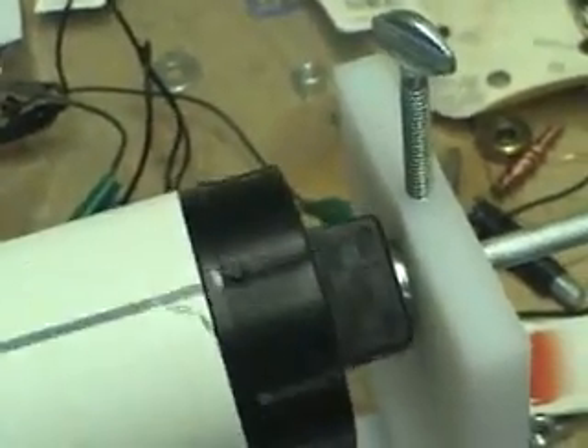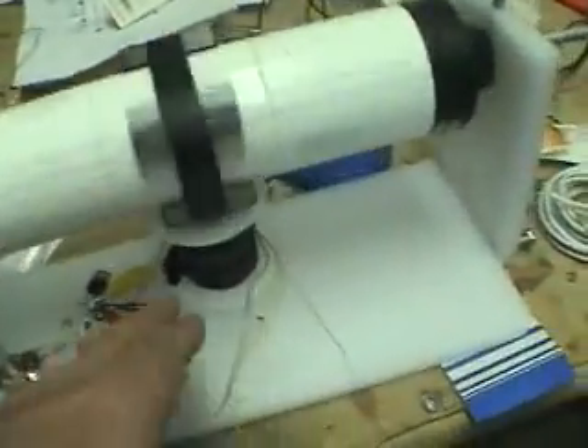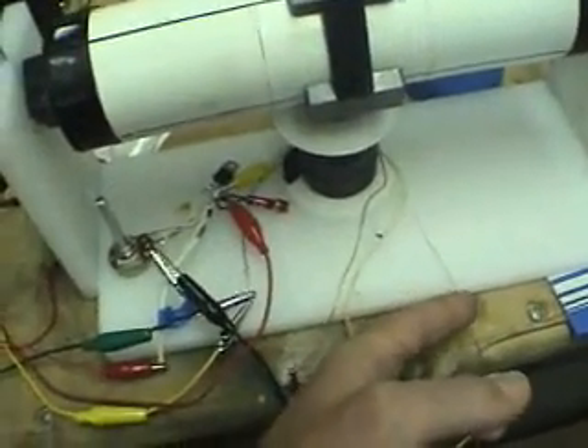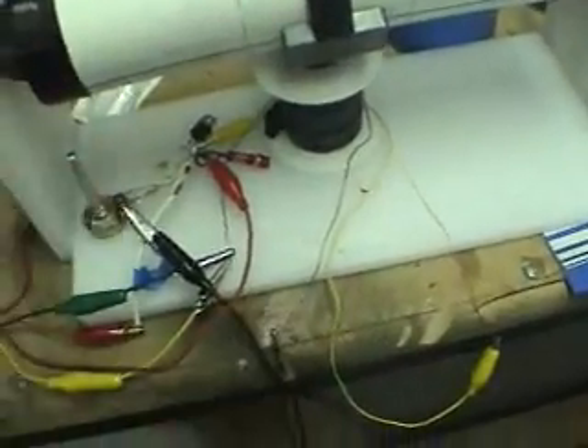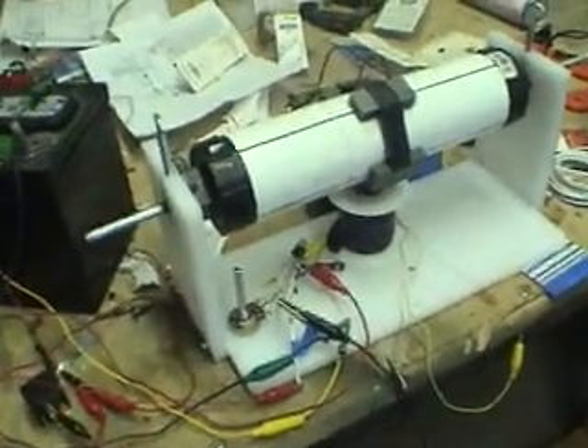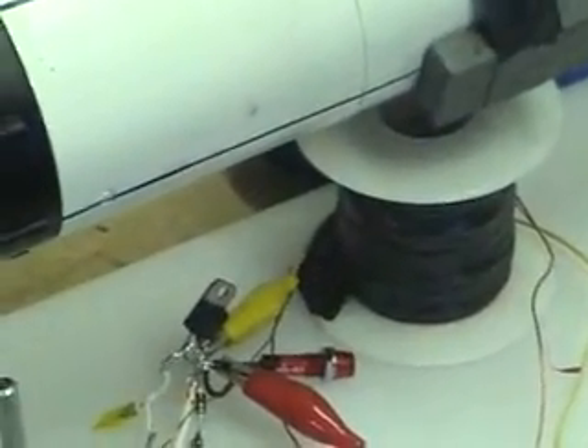I thought that was pretty cool — I just tapped it in and got these nice little screws so I can take them out. I did the same on the other side. Now I wrapped my coil up. I haven't got my iron core yet but it seems to be working quite well without a core — you can see the coil does not have a core. I want to show you how the Bedini circuit is working with this new coil. I used 26 gauge wire wrapped together with 22 gauge wire, and I've got about 700 wraps on the coil.